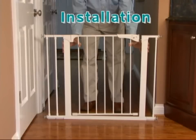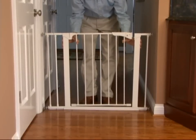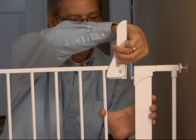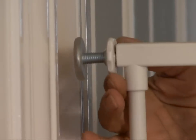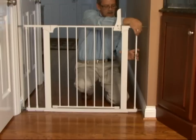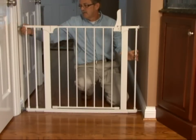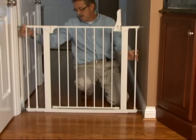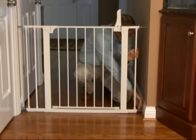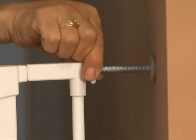When the gate is fully assembled, it is ready for installation. Bring the gate to an upright position within the door frame. Position the handle so that it is upright by pushing in both buttons and lifting. Pull out all four spindles to touch the door frame. Secure the gate by tightening the hand wheels towards the gate, alternating between all four. As you do this, you will feel the gate becoming tighter inside the doorway. Each spindle adjusts individually and may be extended to varying lengths to allow for molding or uneven walls.